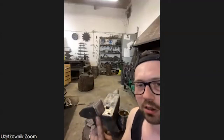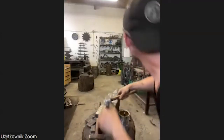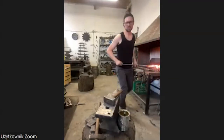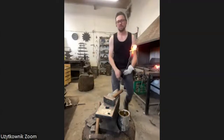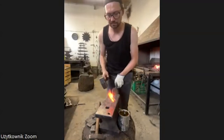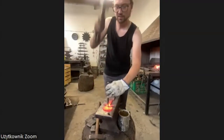And I like the hammers when they are very compact, very short, very thick, in a square. I work a lot with the edges to move material fast. What Uri Hofi also told, and also my blacksmith master, is that it's good for the hammer to be short, because then when you use the corners, the hammer is not moving left and right.